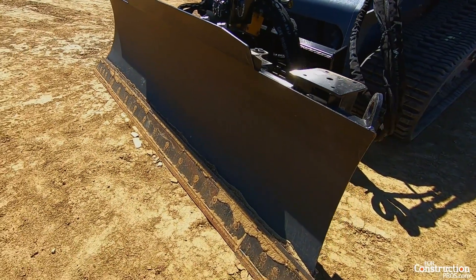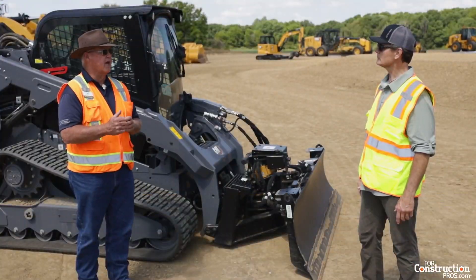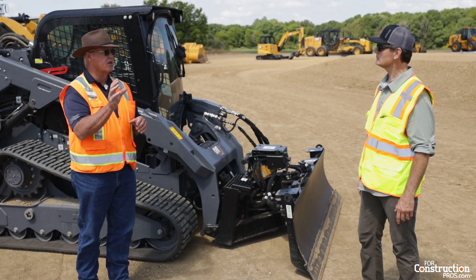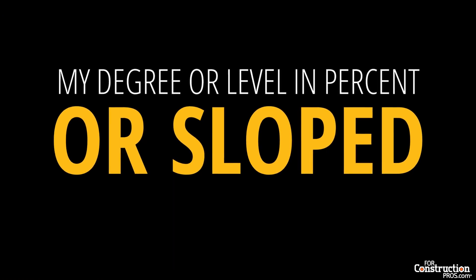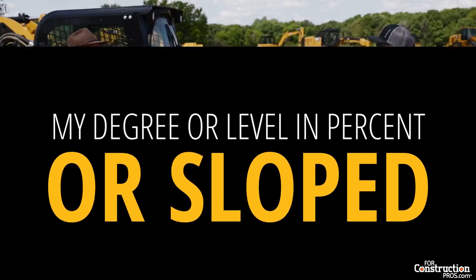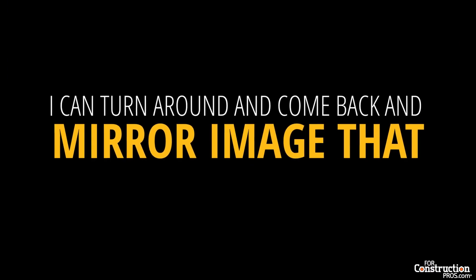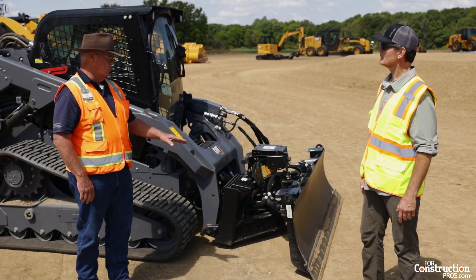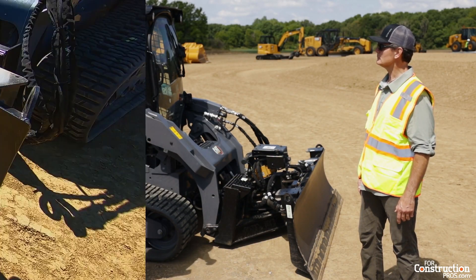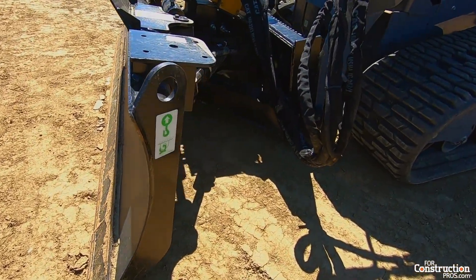You can set your slope within the cab. You can memorize the degree — it's all in the advanced machine display, showing you your degree or level in percent or slopes, whatever you want. Once you've memorized that, as you're cutting a ditch or working on a grade to a road, you can turn around and come back, mirror image it by hitting a button twice. Then to go to grade zero, hit the top button once and you come back to perfectly level. It's a real dream for an operator to run.